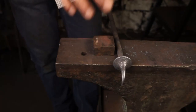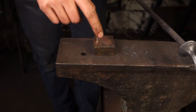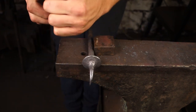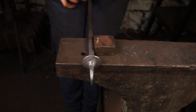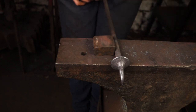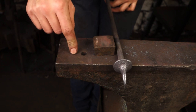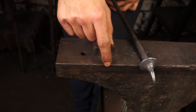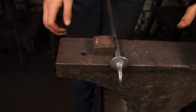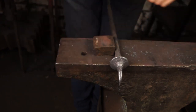I'm going to punch all the facial features of the witch on the anvil rather than trying to do it in the vise. I'm going to use this block just to hold it — when I'm forging on one side of the face I can put it on this side so I'm forging into the block, and when I'm forging on the other side I can hold it there. You could hold it on the step but the hat sort of gets in the way. The reason I'm using this smaller anvil is because this tool fits in it, but also it has a really sharp edge on the back. If we're forging on a radius edge right up next to the hat it will bend, so we need that nice sharp edge.